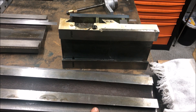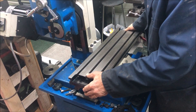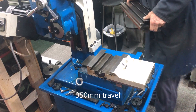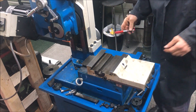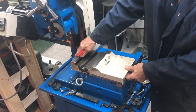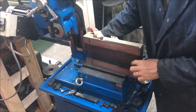But I will scrape that. It has a throw of approximately end-to-end of the saddle, which is okay. And then the throw here is of course only until you get here. You can wonder why they didn't leave this machined so you had full support. I don't know. But at least I would have wanted this to be extended all the way through here.